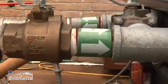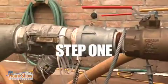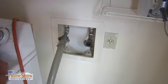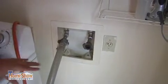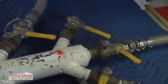The pipe relining process is performed in three steps. First, hoses are attached to all the access points in the house, including toilet sinks and showers. We've got an air hose connected right now to the hot side of the washer and that's being dried. If you actually feel this hose, you can feel that it's warm to the touch. By actuating these valves or partially opening or closing these valves, we're able to control the amount of air that we're introducing.